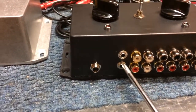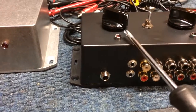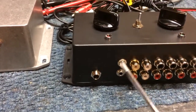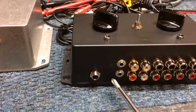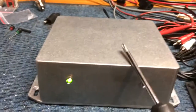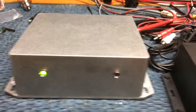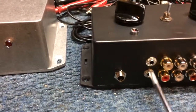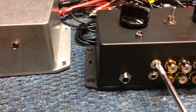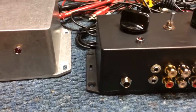The third option in this box is a speaker loop-through. Whenever it's in operate mode, it doesn't matter which amplifier you choose, but you have to have the correct radio selection. If you want to mute receiver audio — for example, if you're using a Johnson Valiant transmitter with an old Hallicrafters receiver — this is basically a modern version of a Dow Key Relay. On receive, these two jacks loop through ground and the tip for a standard 1/8-inch mono connection. On transmit, it breaks the connection to mute your receiver.